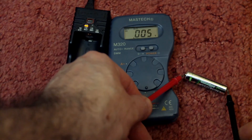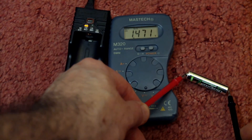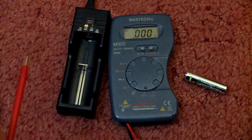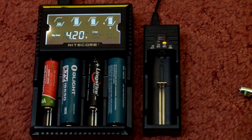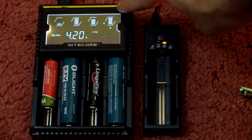You want a constant current for lithium. Testing the termination voltage on the NiMH cell, I have 1.47V — I'm looking for 1.45 to 1.5, so that's absolutely bang on the mark. I'm very happy with the voltage terminations on this, and I've been using it for a solid week without seeing any problems with overcharging or obvious undercharging. The battery detection for a fully charged battery is quicker on the D4 — it detects almost instantly — but it takes a few minutes on the Clarus, which isn't really a problem. It also shuts off charging after that period.